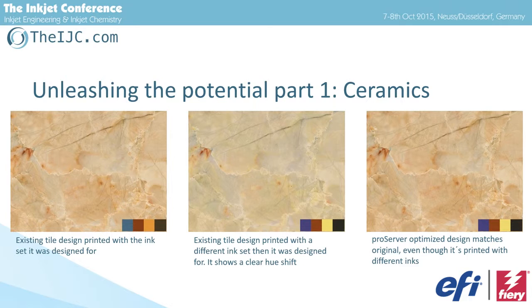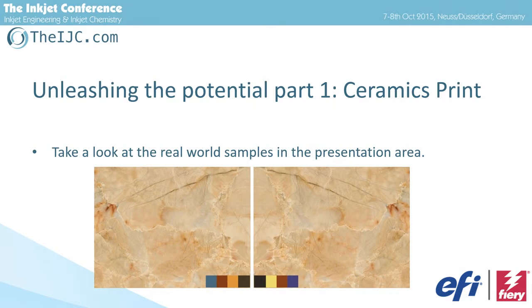Purging all the ink and refilling it with another ink is costly. Plus, ceramic ink deviations from one shipment to the other are enormous — it's not like in production areas with UV ink. So what we did is a kind of repurposing ability: printing the same visual appearance even if you have different ink sets, as long as the gamut shape is close enough. We can't simulate a light green if it's not there in the final ink set.